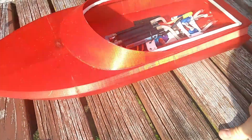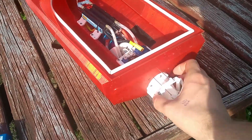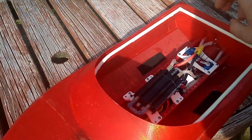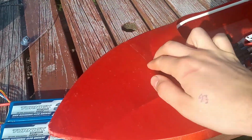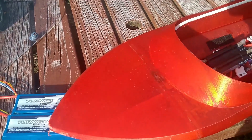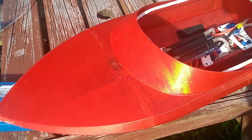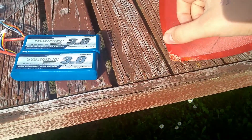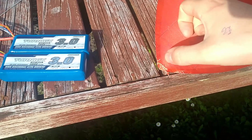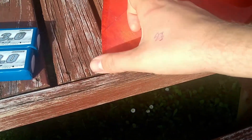This is just about ready for release. I'm going to reinforce this area and increase the thickness of all of that. I'll definitely put nut traps in there, and I'm still finishing the vacuum pump system. I'll add radii on there and thicken the mating surfaces so the glue has better adhesion to prevent cracking. I'll probably also make the front section solid from about 10 to 20mm back, so that if you ram something it's less prone to dinging and won't get leaks.